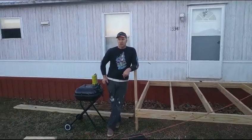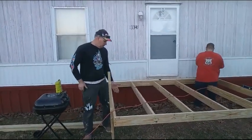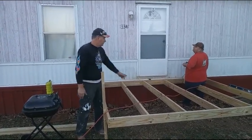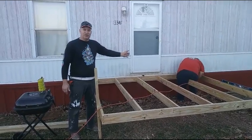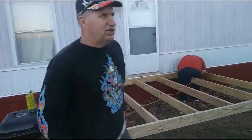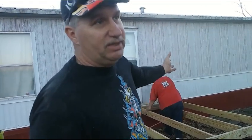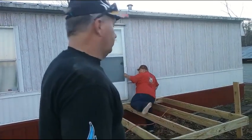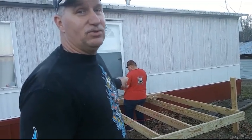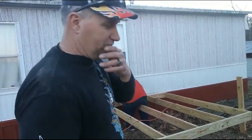We're going to put eight-inch lag bolts with washers — it's really important to hold this frame to the house. Then we're going to put supports out here at six foot with a two-by-ten on each side. I'm using an electric impact, but back in the day I used to set them with a hammer first and then ratchet in. That's from Harbor Freight — I did used to have Snap-on, but the Harbor Freight one works just as good. My Harbor Freight worker is using the Harbor Freight tool. That house will not pull off the structure. I've never had a problem, not one time.